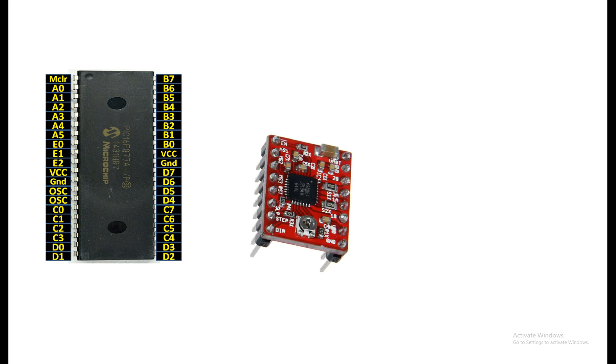This is our PIC16F877A microcontroller having 40 pins — it's a DIP version. And this is the A4988 stepper driver module; this is the cheapest you can buy in the market so it will have its limitations. You can see the small potentiometer — this is for limiting the current. By default this A4988 comes calibrated, but if you have a different sort of NEMA motor you can rotate this using a screwdriver to adjust the current.